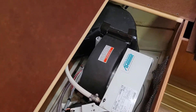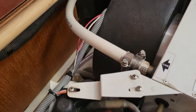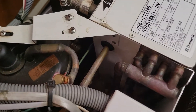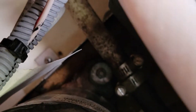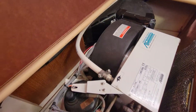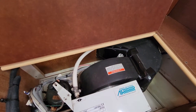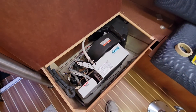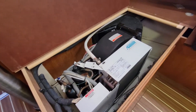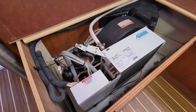Here's our old air conditioner. The run capacitor caught fire because the compressor is old and rusted. You can see right down there how rusty everything is. This is the Marine Air 18,000 BTU. I could change that one part and have it run and then have it serviced — always get an AC with charge ports on the suction side. But we're just going to replace the whole unit since we already put a brand new 6,000 BTU in the rear aft cabin.